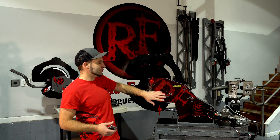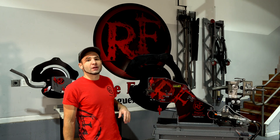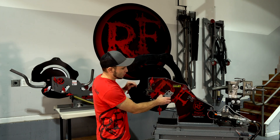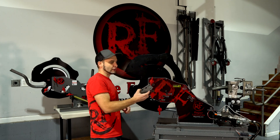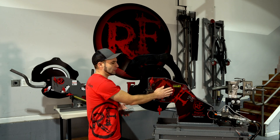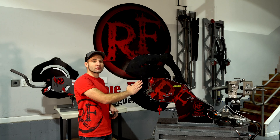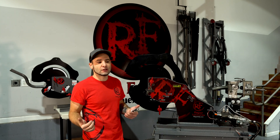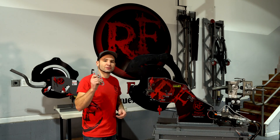Today at Rogue Fabrication, we're going to retrofit one of our vintage model 600 tubing benders. These ran from about 2013 until late 2021. The M625 replaced the 600xHD, and added a fourth pressure die location, so we'll be drilling out this last hole, welding this plate on, and then repairing the rack. We're also going to change out the bandwheels to allow bends closer together on the smaller centerline radius dies, such as the two and a half and three and a half inch CLR.